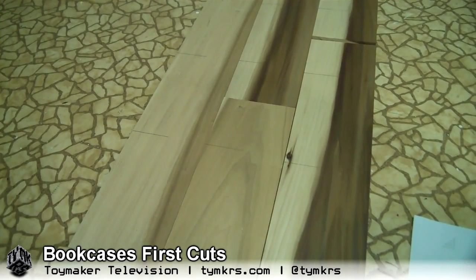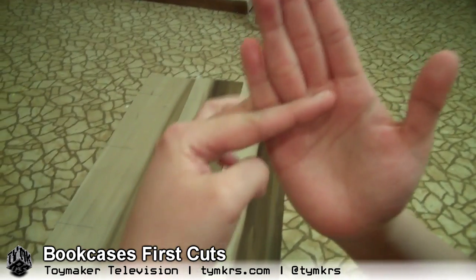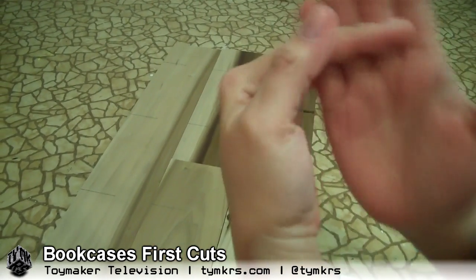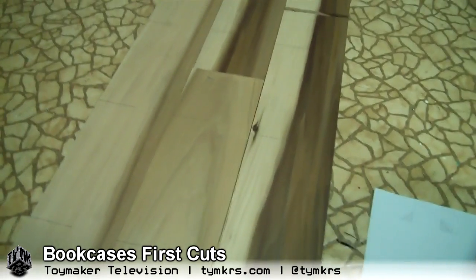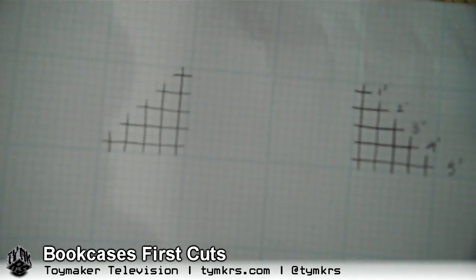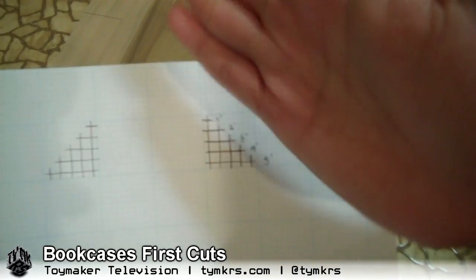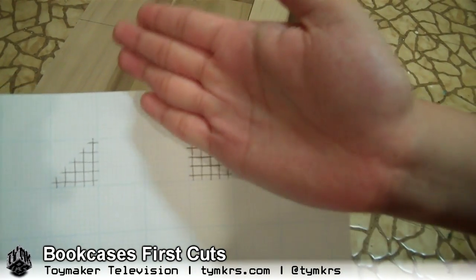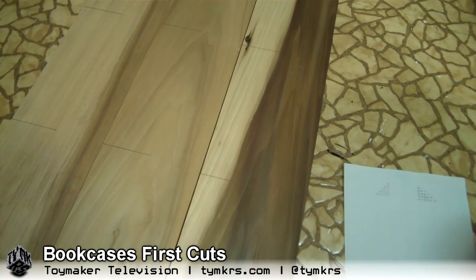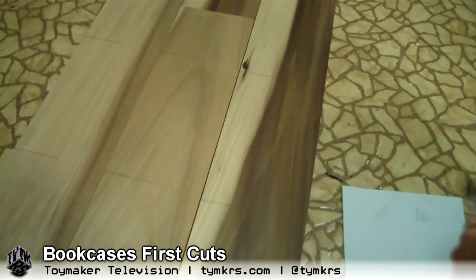The thing I had to keep in mind was I wanted the verticals to hook into the horizontals — both would hook into each other. When you work on a bookshelf like this you have to know what angle they're going to be at. So like this bookshelf, for instance, would be at this angle towards you, and so you want the nicer wood facing that direction — which bits of the wood you want visible to the front side of the shelf. That's clever.